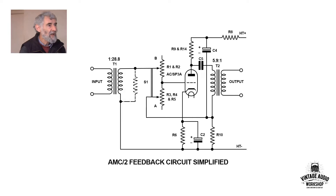At the input end there is a dotted resistor. This resistor does not exist — it is there for explanatory purposes. If it did exist, it would be 250K, which is what the transformer matches into. In practice, the actual load is these two resistors. The double bar notation represents ganging between two switches; these apparent variable resistors are in fact switches, not pots.